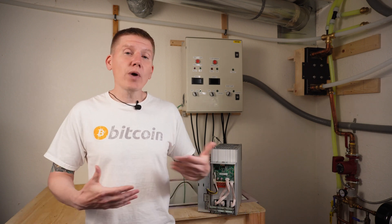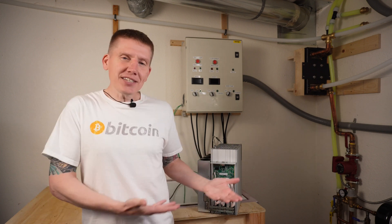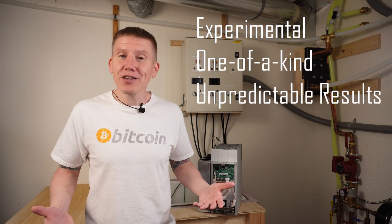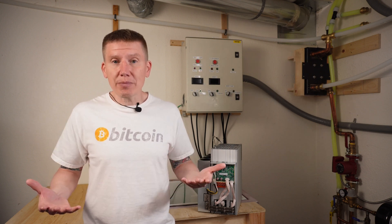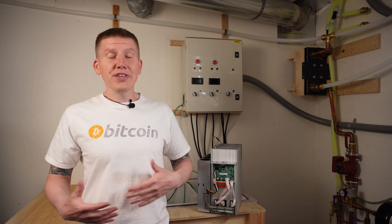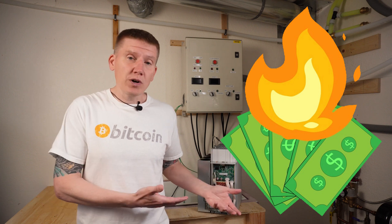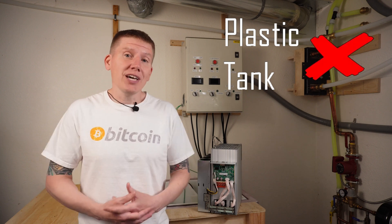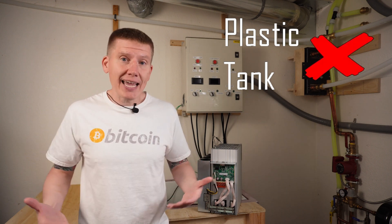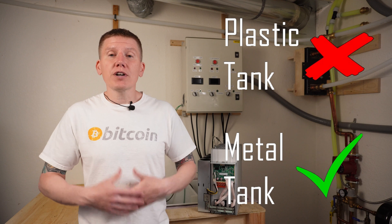When this happened, I was away at my 9-to-5 job. And this is why having a control system is a really good idea. These systems are experimental — they're one of a kind. We're all going to be figuring things out as we go, and sometimes we're going to make mistakes. In this case, my control system caught that mistake and prevented further damage. Now, this is a huge setback. I spent a lot of money on this tank, and even if I were to fix this one fitting, the other fittings would fail eventually as well. So a plastic design is really not a good idea. If you look commercially, pretty much every tank is metal. I'm going to have to go with a metal design, and I'll be covering that in a future episode — how I salvage what I have and go into a new design that's going to work much better.